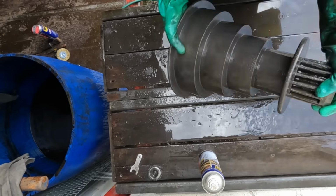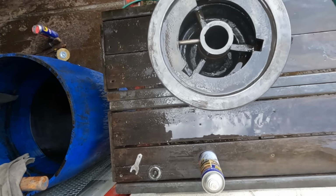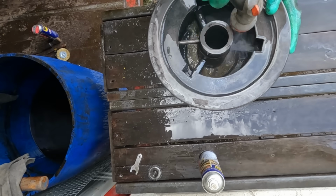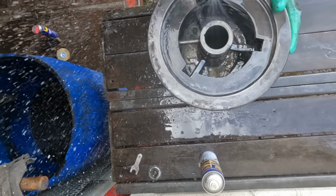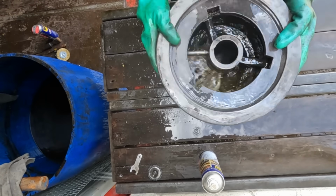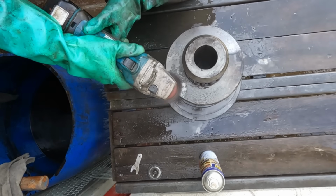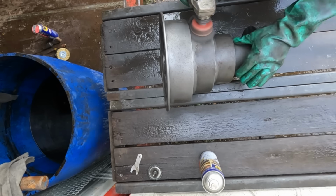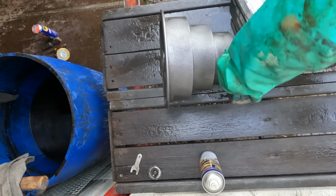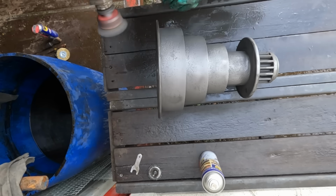There is meant to be another cone identical to this, which when mounted on a countershaft in the ceiling in line with the cone on the machine but flipped the other way around, a single belt may be moved about the 4 steps. When the countershaft is driven from a line shaft or another form of motive power, we can gain 4 distinct speeds using the steps by shifting the belt between them. This other cone is obviously missing, and making it again from scratch is going to be one hell of a challenge on this project. Luckily, it doesn't need to be as complex as this cone.